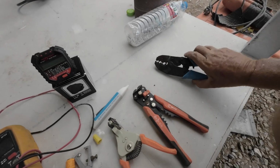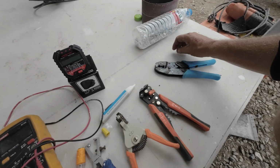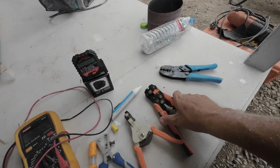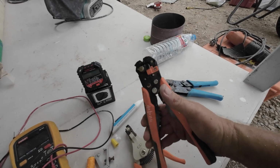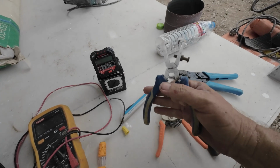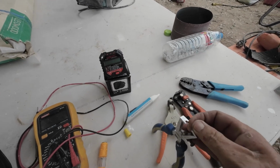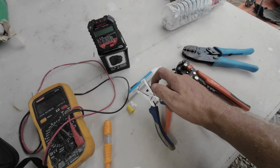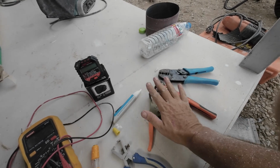That's my crimp tool for the thing I've shown you. For these, if you want to crimp that, I've got a smaller one anyway. My stripping tools, so like 2.5 cord sleeved cable, great for stripping. This one strips just the cable on its own. This one I use the most, because I use single core a lot. It's totally adjustable, so you just adjust it by screwing that in, for different types of cable. So this one I use the most, more than these.